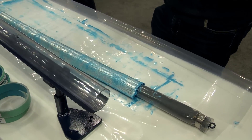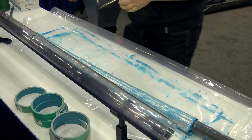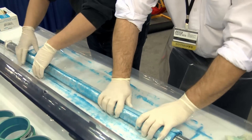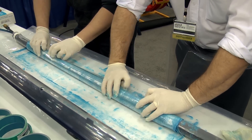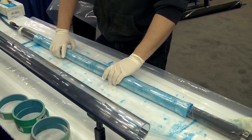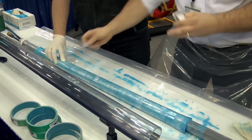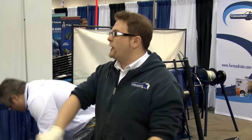Now that that is done, we're going to put a protection layer over it. If the liner loses too much pressure, you're not going to have the structural integrity you're looking for. For the purpose of the demo, we're going to use office scotch tape to hold that layer in place. What we usually do is U-fold it and tape it, then press it so it gets even smaller and is easier to get through a clean-out.